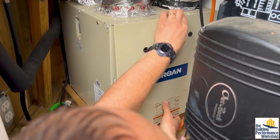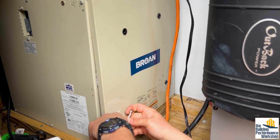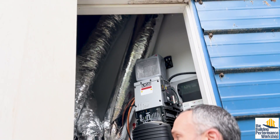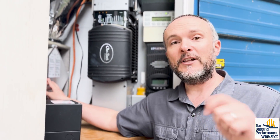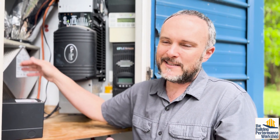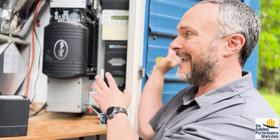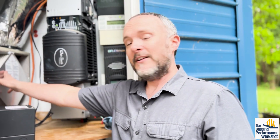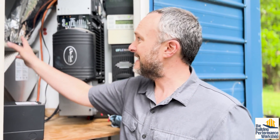I still prefer this ERV over any other one on the market right now because this is a 70 CFM max unit. It's not an electronically commutated motor — an ECM unit — which would mean that it's infinitely variable and you can dial up and down. You just kind of choke down the dampers on it, which is what we do. It's not as energy efficient, but I'm running this on the lowest flow possible so that I can have my house not be breathing more than once per hour, which is what we do with this house. When this thing is on, it's replacing all the air in the house once per hour, even at 30 CFM. Any other ERV is going to be much bigger than this, and the configuration was really limited by the space constraints.